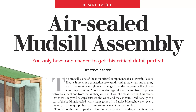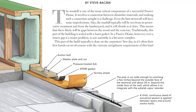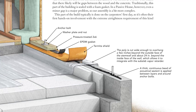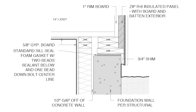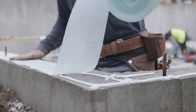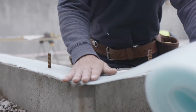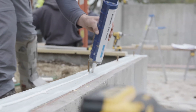The process for this is pretty straightforward. I'm sure you've seen articles in Fine Home Building about it before, but the mud sill connection is one of the notorious leaks in a residential home historically. We've solved that problem, as many before us have, with sealant and a foam gasket. There are also higher-end gaskets that you can use that are self-sealing supposedly. What we're using today is an approach of two beads of Big Stretch across the top of wall. Then we set a standard foam sealer gasket in that Big Stretch caulking, and then we do another bead across the center line of the bolts and around every bolt.